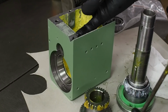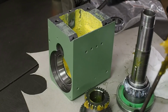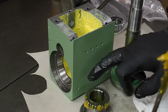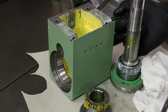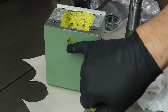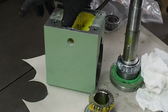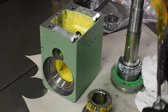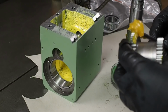On the one hand, obviously you'll need to put some sort of a floor in here to seal it, but then you're going to need to cut a window somewhere else in the side so that you can actually insert the gear as the shaft goes through. You're also going to need to have some sort of a solution for a seal on the change lever port and the 2 lower shaft bearings, and I guess the whole thing to me is just not worth it. I'll just accept that it's probably going to be noisy.